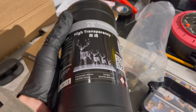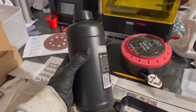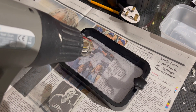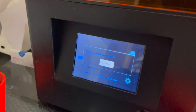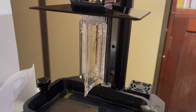Here's a quick look at the bottle — it's got some nice images on it, so hopefully it lives up to those expectations. We've also got a QR code that you can scan if you want to do some further investigation. Always got to give your resin a shake and then pour it down into the build vat. It's very bubbly and also very, very fluid. It's very important not to have any bubbles especially for clear resin, so I'm just going to blow these out with a heat gun very quickly and then get the print started. The print's finished — looks like it's worked out alright, looks really clear. It took 16 hours 34 minutes, which is quite a long print, but this is just a standard LCD printer and they say the resin is designed for the monochrome LCD ones which obviously print a bit faster.